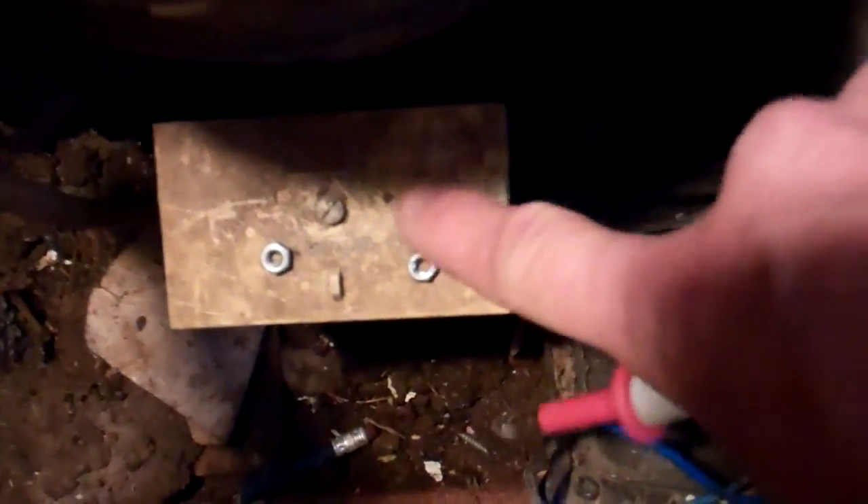That's on the HP switch cable - other end is disconnected. You can tell, right, that is on the fan motor. So on the blue wire, that is on the HP connection, so that is okay. We've got that test lead on the blue wire from the run cap - it's not got an actual connection itself so we'll just put the other lead on the case. It's showing nine gigaohms, so that's seeing that is okay. We'll try it on the other lead just to be sure - that is also a big gigaohms reading so that's fine.